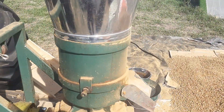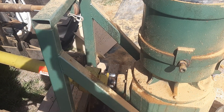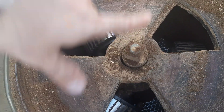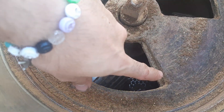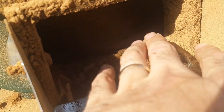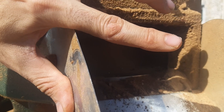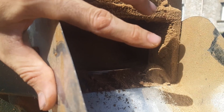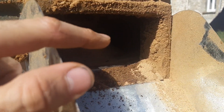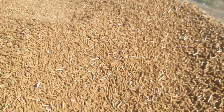I bought the pellet mill again from China, from Alibaba, imported it. It's a PTO shaft, a 360mm die plate, and it works fantastically. It is roller-turned, so the driveshaft connected here turns the rollers to a fixed die plate, and then down here the driveshaft comes all the way through and there's a rotating platform. There was a knife that cuts off the extruded pellets, but I found it was a bit too forceful — about the width of my finger in mild steel — and it was bashing the pellets about and breaking them into quite small pieces. So I've taken that off and welded a little plate, much lower than the original, so we're getting a better output of pellet.